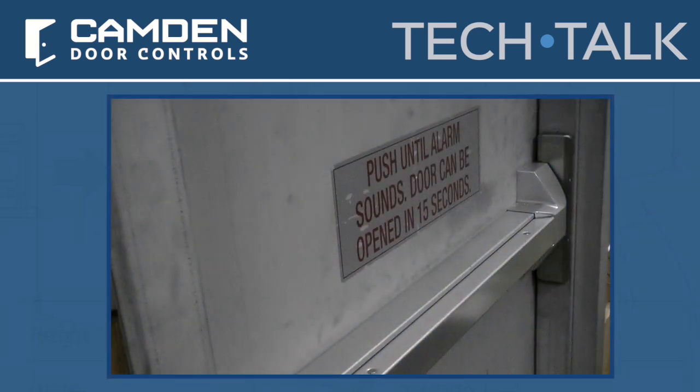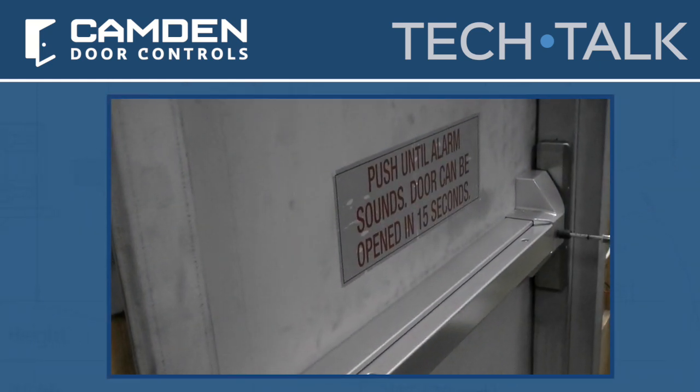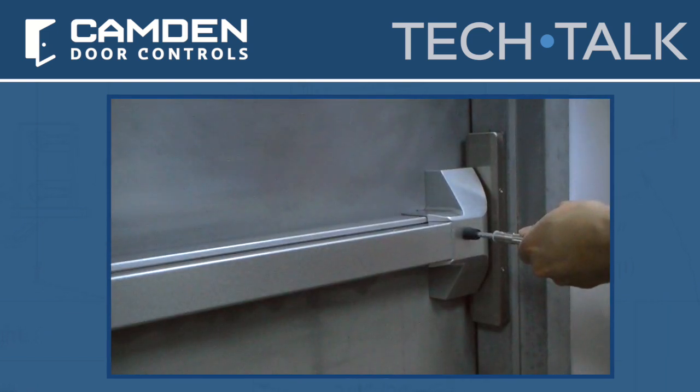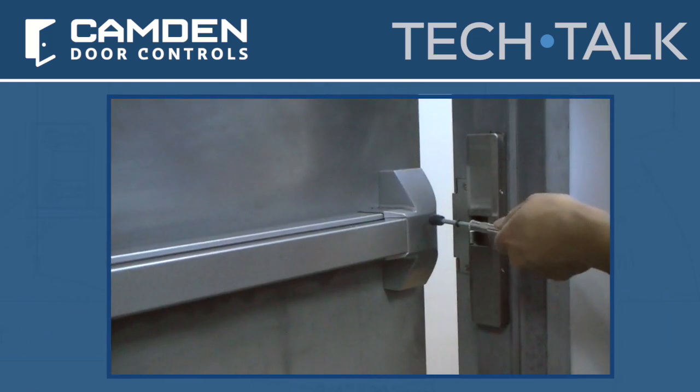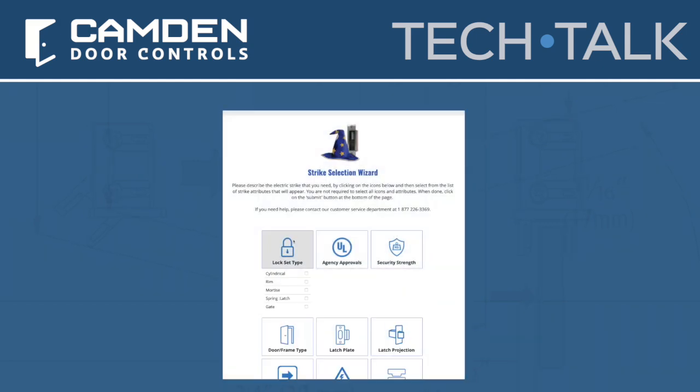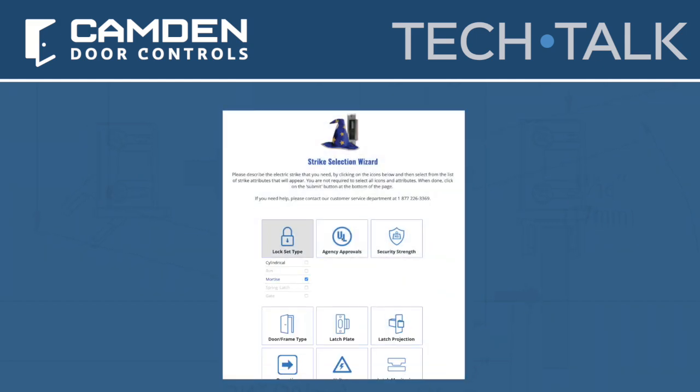Preload is when pressure on a door latch applies pressure against the strike keeper and prevents the strike from opening. This is common when a strike is installed on stairway exit doors. This video assumes you have selected the right strike for the door, frame, and lock set. If you want more information regarding strike selection, please download our selection guide from our website or go online to use our remarkable strike selection wizard.